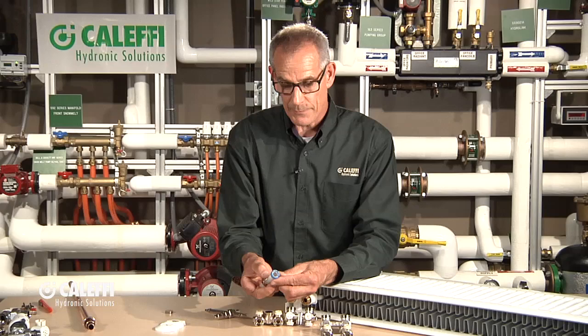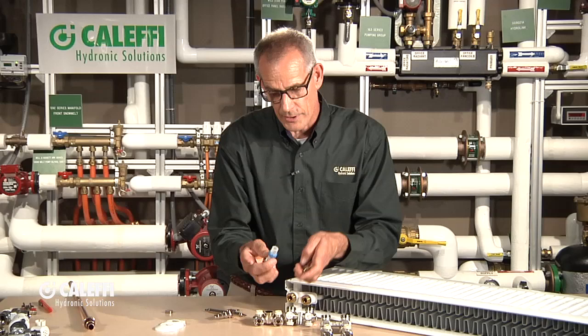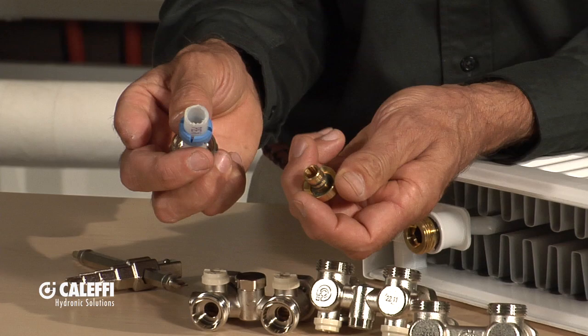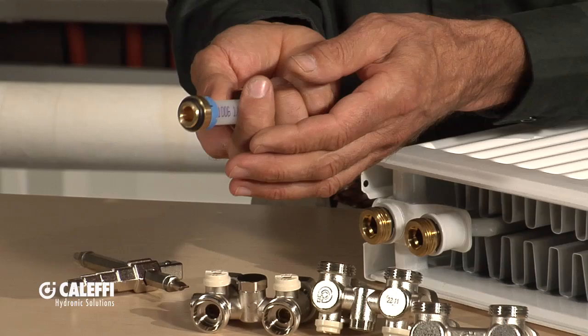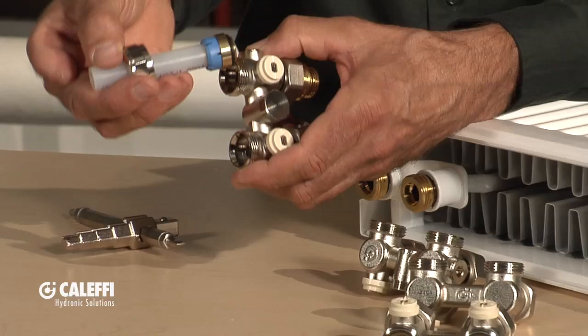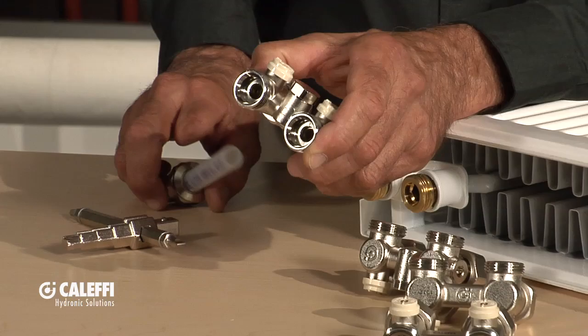The first option is a PEX fitting — it's very similar to the PEX fitting we use on our manifolds, same thread, but chrome plated because you'll see it in the room. This PEX adapter is pretty unique in that it has a segmented olive, which takes up tolerance if your tube is a little out of round or oval from being coiled. The insert has a double O-ring for a good seal on the inside, and it's tapered so it goes in tight. It has a nose O-ring so it makes a good seal into the valve.